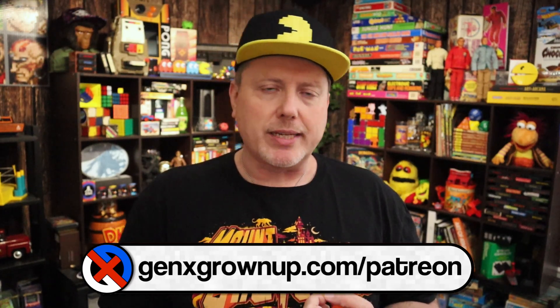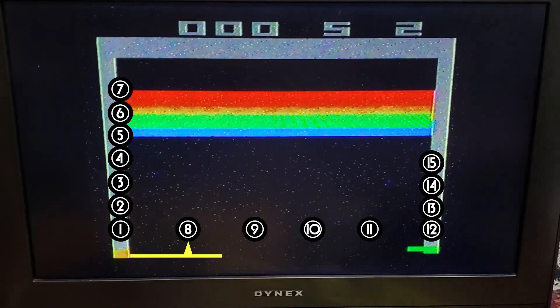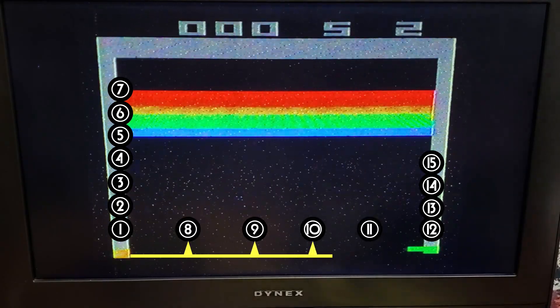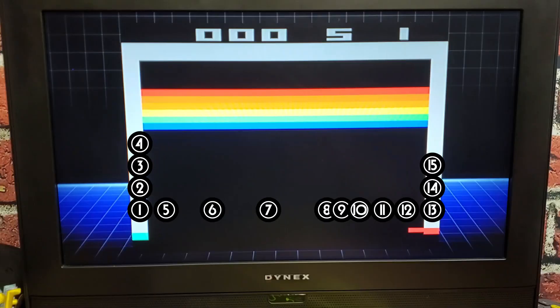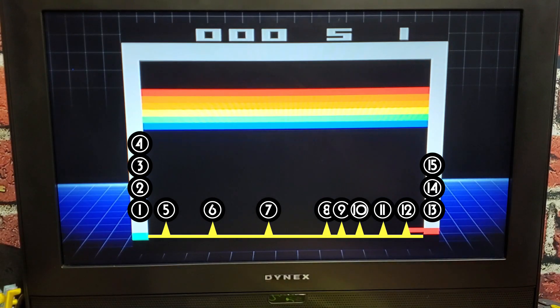Rotating the paddle the same distance has dramatically reduced the distance your player will travel on screen. These results really crystallized in my mind what I was feeling when playing with these paddles. There's a little latency because of the analog-to-digital translation, and maybe we can't get past that, but if movement was consistent my brain could adapt. First and foremost, on an original Atari it takes about five centimeters of rotation to go from the left to the right side of the screen; on the AT Games it takes about eight centimeters to move from one side to the other.